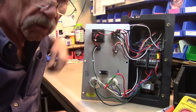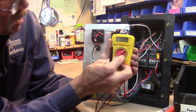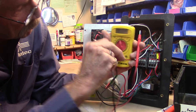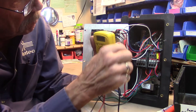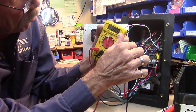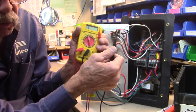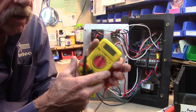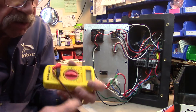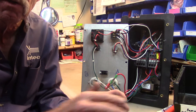For troubleshooting on remote cords themselves, remote cords can be ohm-checked with your meter. Set your meter to ohms. Always put your plugs in the correct position to measure ohms. Put your two leads together to make sure that they zero out. Once they do, you can use this to check the continuity of wires going out to your remote cord. Frequently you'll have breaks in those wires, and they'll usually happen right at the remote end or right where they go into the machine, which is where the wires flex the most. If you're having a problem with continuity, check those areas.